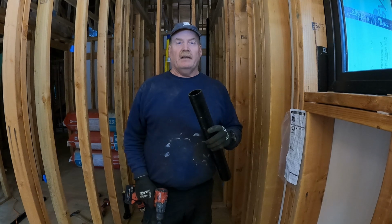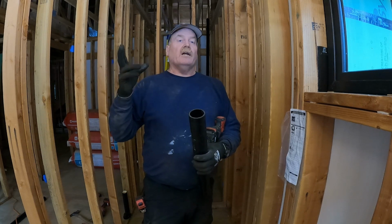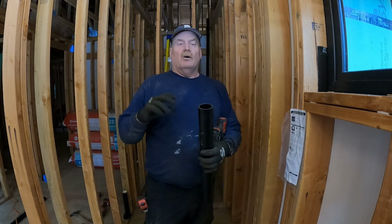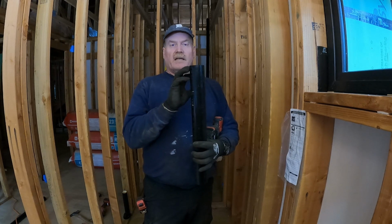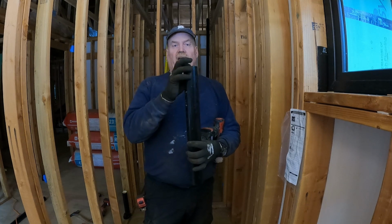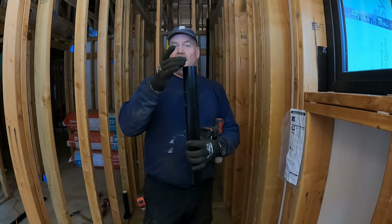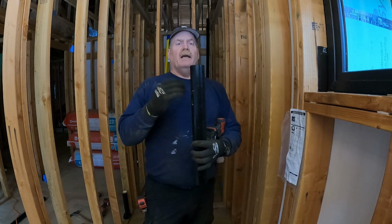And then of course you're going to ask, well, why are you running such a big vent up out the top of the house? Well, we are in snow country, and there is a chance of freezing temperatures here. So one of the things that could happen is the air in your vent, if it's frozen outside for enough days in a row, it will start building up ice in that vent. And so having the bigger vent will either give it more time if ice actually builds up before it will clog, or having the bigger vent, a little bit more air movement maybe, and it won't freeze up.